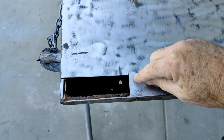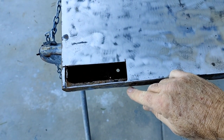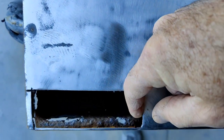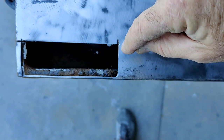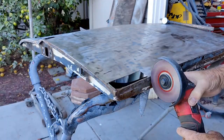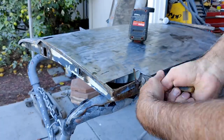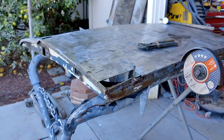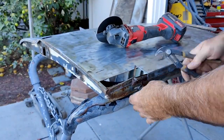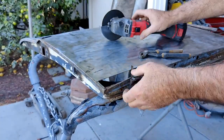What I'm going to do is cut out a little bit further and then cut through one layer here, because I need better metal — it's better about right where I'm at. I just need to go a little further out, make the inner panel first, then make an outer piece. I'm cutting away the outer panel and going to leave about a quarter of an inch of the inner panel showing so I can weld to that first and repair this section.